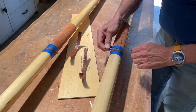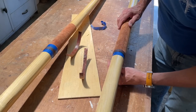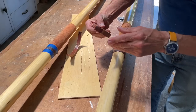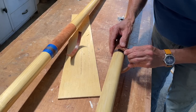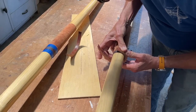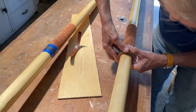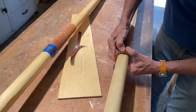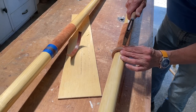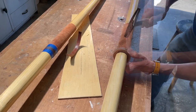First, I want to get this tape off. The thing about contact cement is that you have one shot — once it's touching, it's going to stay right there. So we'll line it up and get started. Some people don't like to do this, but I like to put a little tack in there on the tail. And there we go.